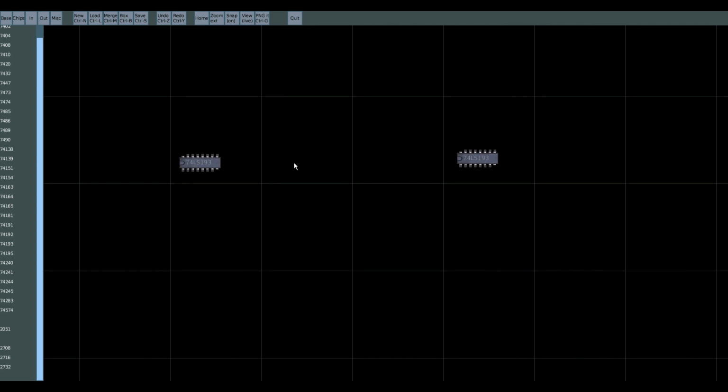So we've got 2 chips, and we need to know what the inputs and outputs are. So the inputs are, again going back to Ben Eater's video, we have a clock signal which will generate and it will count. So obviously on the chips we can look at various items. We've got things like pin 2 is QB, and pin 3 is QA, and various other ones. Obviously the power on this chip in the emulator is already dealt with. We don't need to think about it. So the top left pin and the bottom right pin are dealt with. That's why they're greyed out.